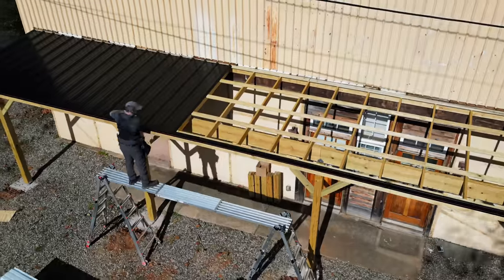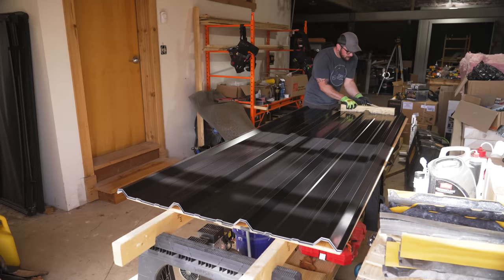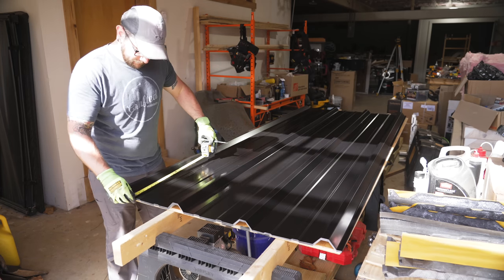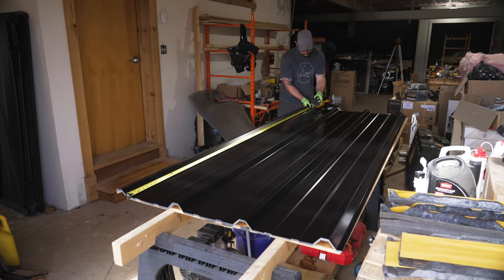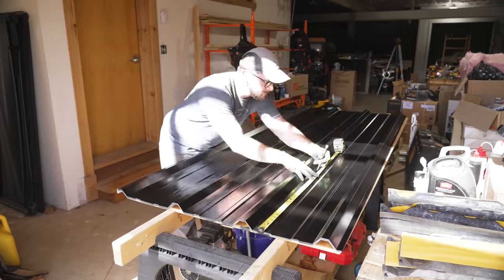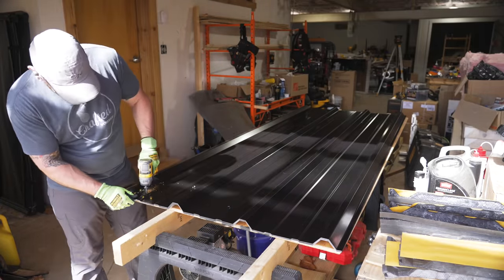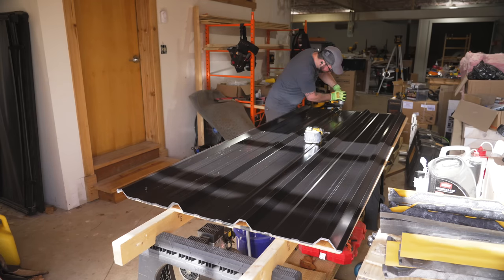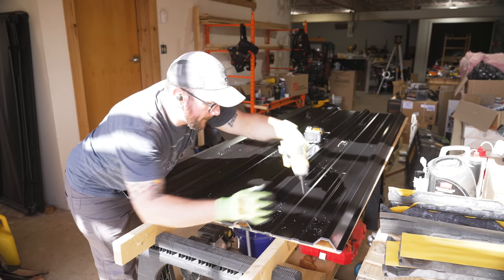We repeated the process for another five panels, with my drone almost creeping into a tree branch while we worked. Before moving on, I decided to go ahead and pre-drill the holes in the rest of the panels, which I hoped would save me a lot of measuring work up on the roof. I started by getting the panels lined up and carefully marking out my hole locations. Once marked, I drilled the first hole and tacked the panels to a piece of plywood to keep them from shifting while I drilled the rest. Overall this went super quick and definitely saved me some time.